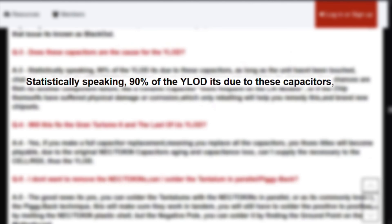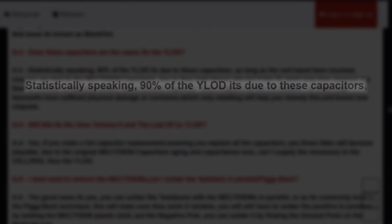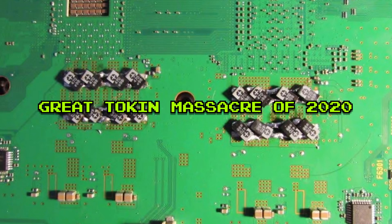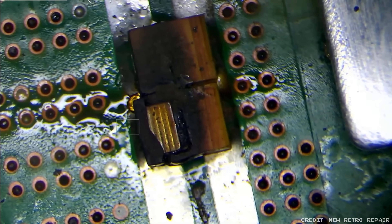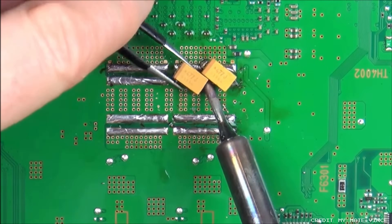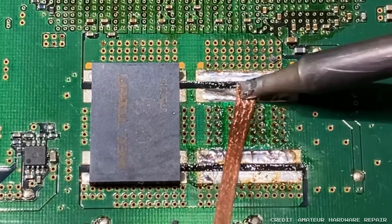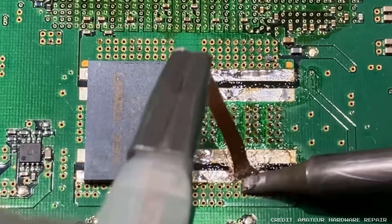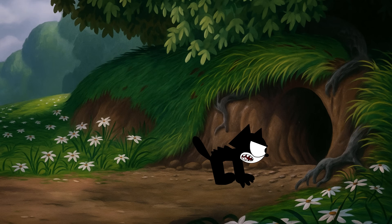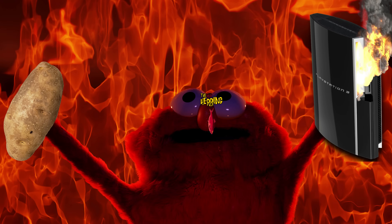Naked Snake was right, just not universally. And that misunderstanding set the stage for what I call the Great Token Massacre of 2020. We're talking about soldering disasters, burnt boards, caps flying off like popcorn, entire consoles being misdiagnosed and destroyed. People slap tantalums on every PS3 hoping to flip an expensive model for profit. But it's way harder than it looks. The PS3's thick internal ground and power planes make soldering a nightmare, even if you're skilled.